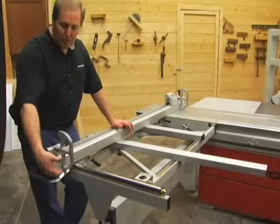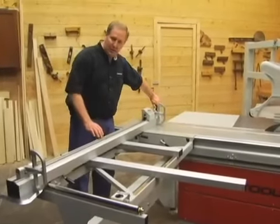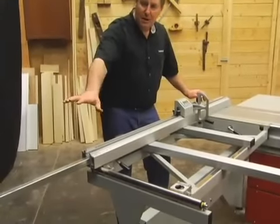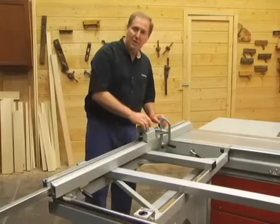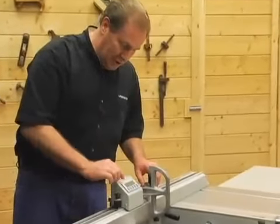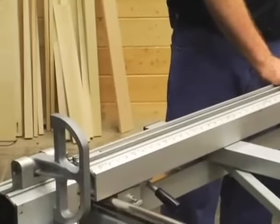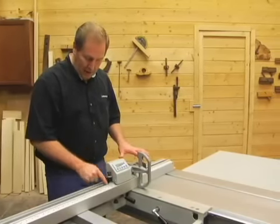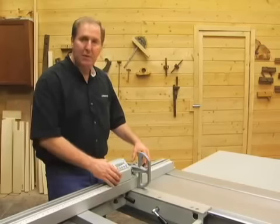You'll also see the shelf on the side — there's a little shelf on the back and the forward side that catches the edge of the panel as you're bringing a panel up. When you telescope the fence out, simply loosen the knob on the inside and slide it out — that's where that catch shelf comes in handy. The digital readout for the far stop is on this stop right here. You've got a 60-inch difference between the stops, and you can read that right here on the digital display. As I move it back and forth, I can read it for both the inside and the outside stop. This is a digital flip stop assembly with a lock pin that allows me to lock into the rail for the outer stop, or I can pull that up and slide it independently as an inboard stop.